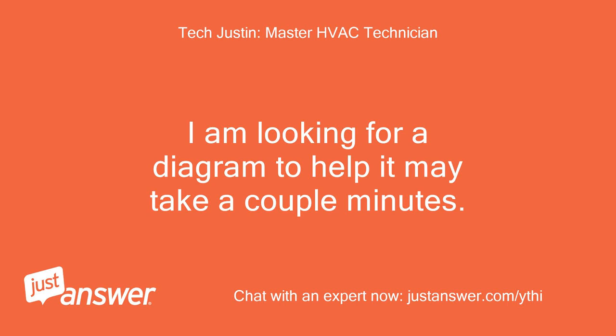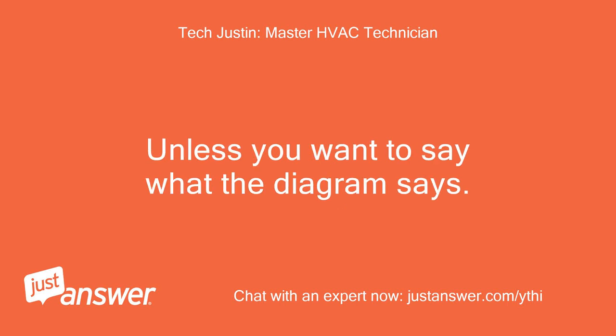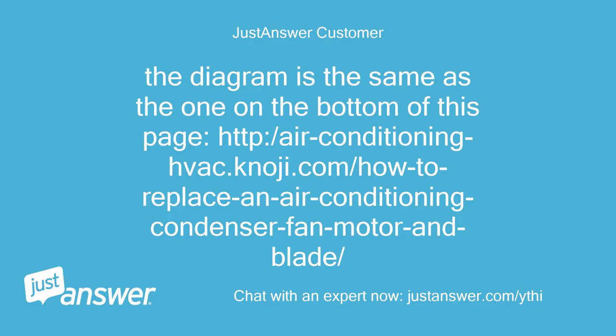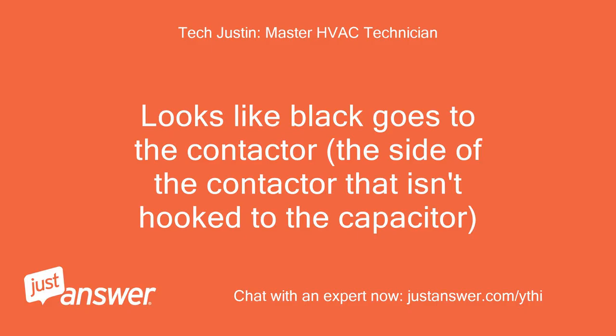I am looking for a diagram to help. It may take a couple minutes, unless you want to say what the diagram says. Looking now. The diagram is the same as the one on the bottom of this page, http://airconditioninghvac.noji.com/how-to-replace-an-air-conditioning-condenser-fan-motor-in-blade/. Looks like black goes to the contactor, the side of the contactor that isn't hooked to the capacitor.